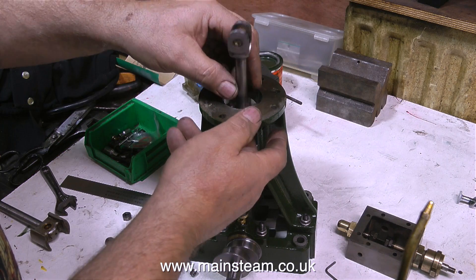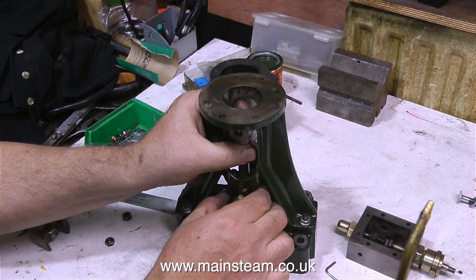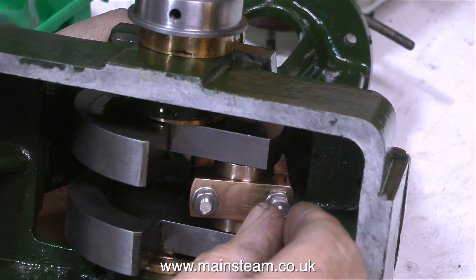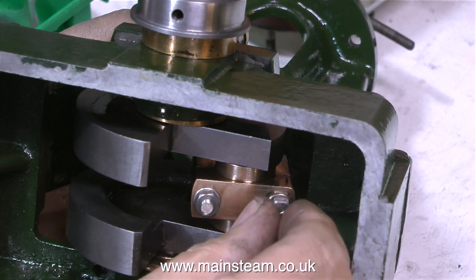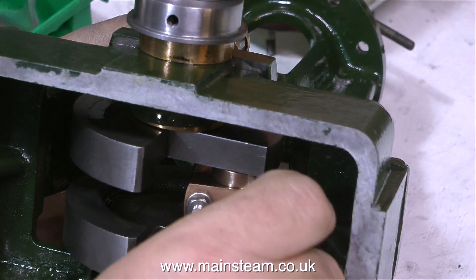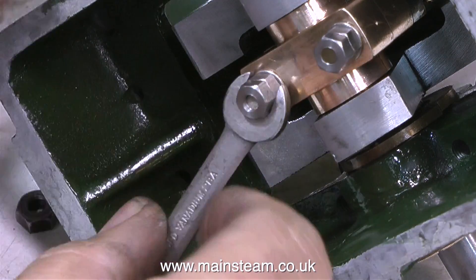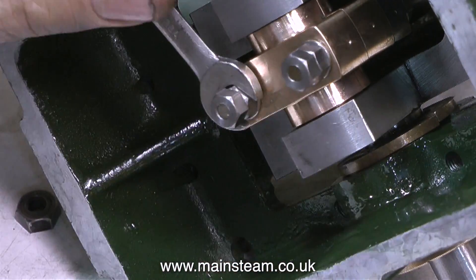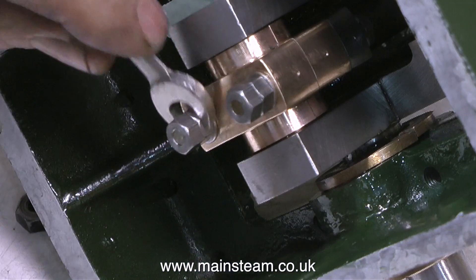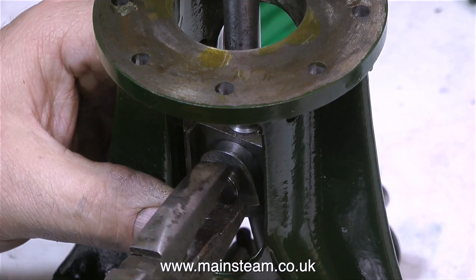Time now to fit the connecting rod with the big end brasses that I made. This part is very hands-on. At the moment I'm attempting to fit the first of the lock nuts, but it's proving difficult to engage it on the thread — and there it goes. So I fit the second lock nut and move on to securing them, making sure these bolts are not too tight. Initially, for running-in purposes, I always leave the bolts slightly slack to give a little bit of play so that nothing tightens up. I've mentioned many times in these tutorials that if you over-tighten steel bolts onto gun metal parts, the gun metal parts will distort and will appear to be tighter than they actually are.